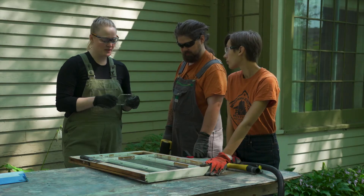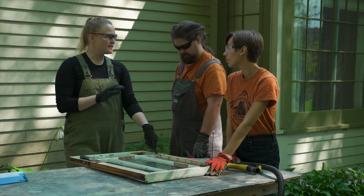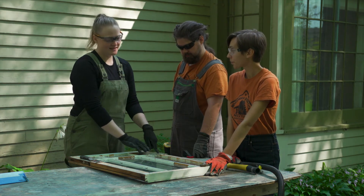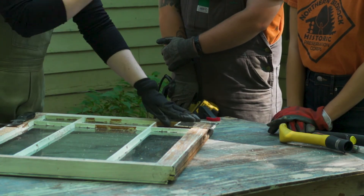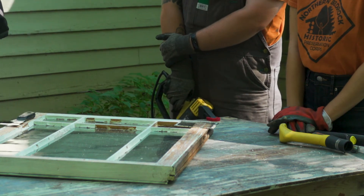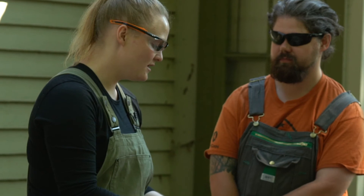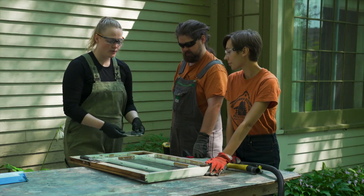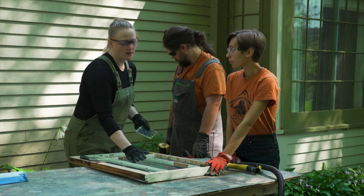When you take this out piece by piece, what you want to do is take a little piece of blue tape and label your glass. I'll put a piece of tape with an arrow pointing upwards and an R. That way, you will know that this is the right pane of glass and that you need to have it situated with the arrow pointing upward. Generally, I always know that the blue tape is on the outside of the window where we're glazing.